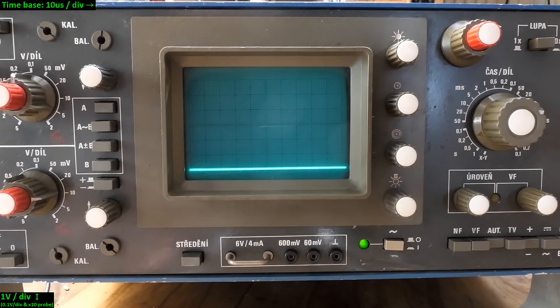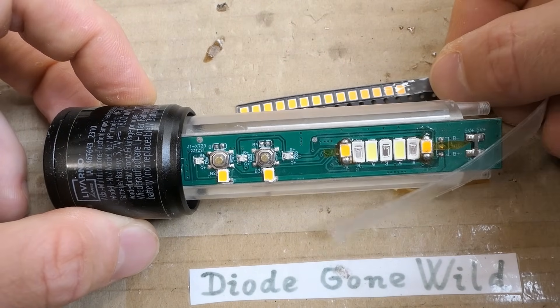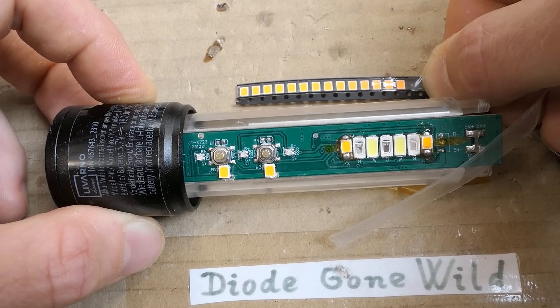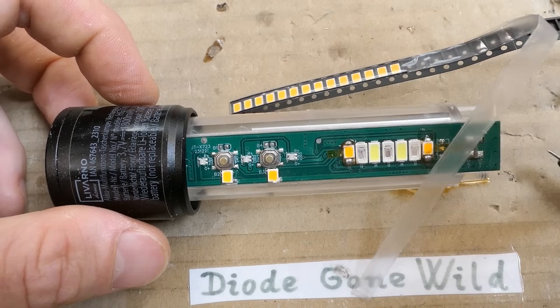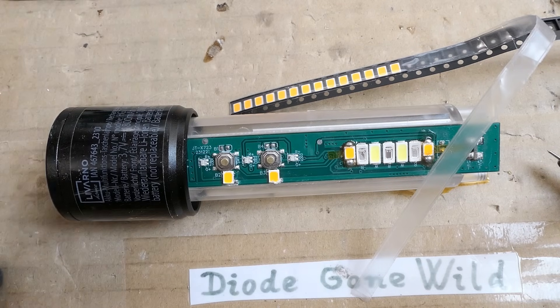The red LED is the only one that's actually continuously on when running — the red one and flashing red. I should also mention that the yellow LEDs I used are phosphor yellow LEDs, not standard yellow. So they drop about 3 volts — their voltage drop is about the same as a blue or white LED, which makes them easier to drop in. It would be trickier to put standard 2V yellow LEDs in. The advantage of phosphor yellow LEDs is that they can be about 3–4 times more efficient than standard yellow LEDs.